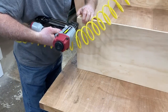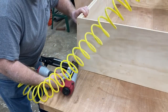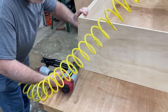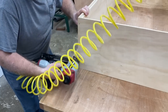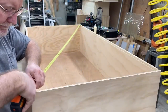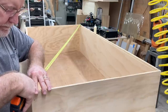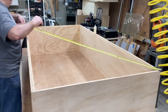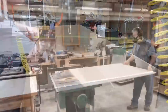With a two inch long nail in three quarter inch material you have to be very careful — if you're misaligned, you'll shoot that nail out the side, which is certainly not what you want. Keep the fingers out of the way. Now that the box is completely assembled, I want to check for square. You cross the tape measure from opposite corner to corner and measure both diagonals — those measurements have to be the same. With a slight adjustment I've got it square and we're ready to move to the next step.